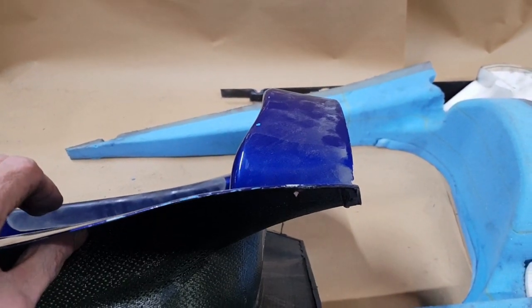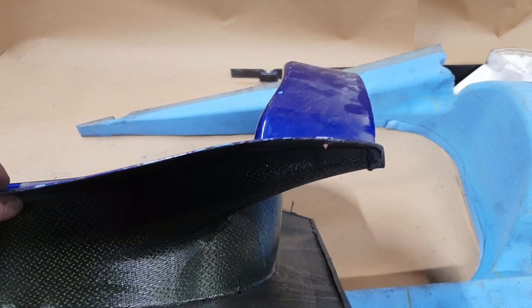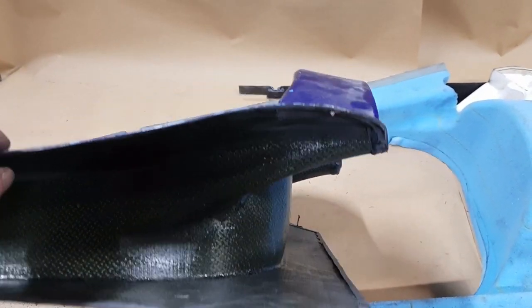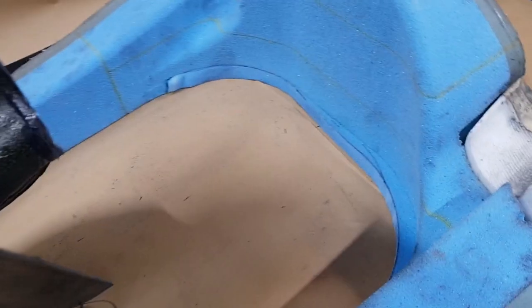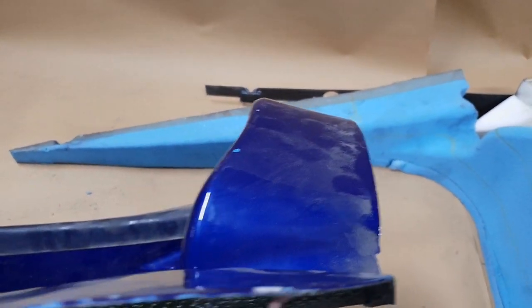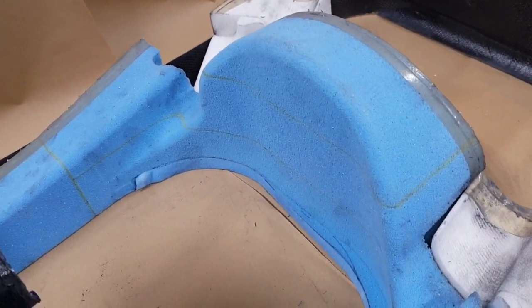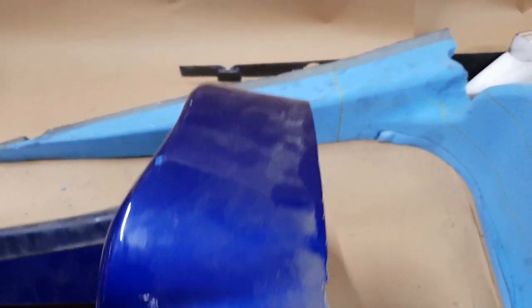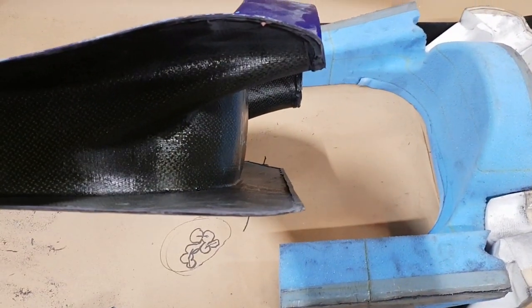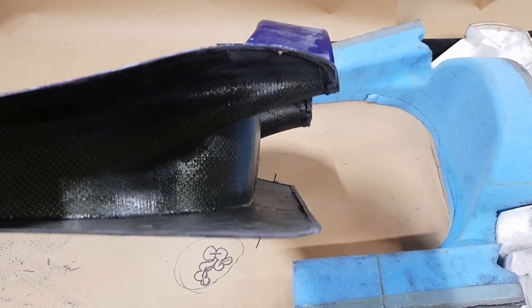Now, this makes me believe this was designed by someone that was not too experienced on the shop floor of carbon fiber layups and general foam assemblies, but he or she designed that part with the bottom section there, which was removable, because when they inserted this foam part here, it would get caught going in this direction. So the purpose of that part there was you could deflect down this foam assembly, bend it down to fit underneath this undercut on this side, then deflect it up when it was inserted, and then insert that bottom piece. Now that's probably a bit confusing to some viewers, but someone that's working with mold tools and injection molds, die casting molds will understand what I mean.